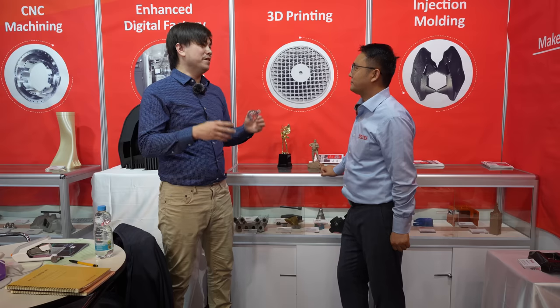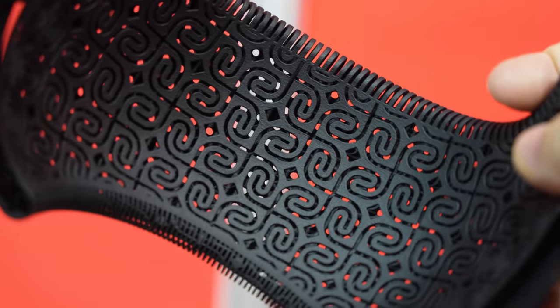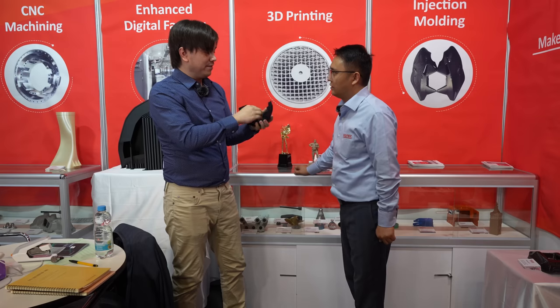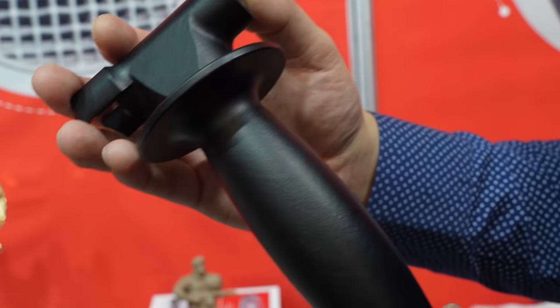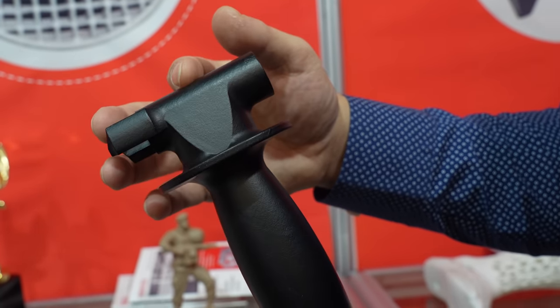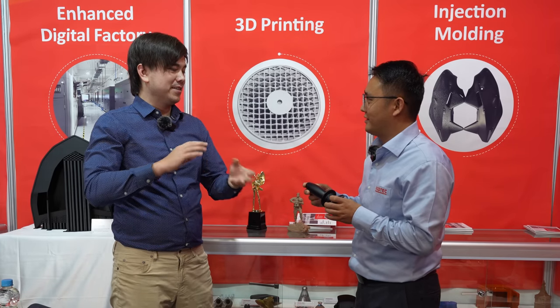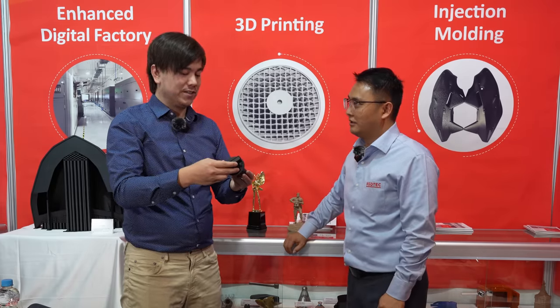So like if you had a movie set in the future and you need some costume elements, you can print those out. You were showing me this helmet earlier — it's kind of interesting. It's got this spring pattern built into it, so it's making a flexible element out of a hard material. MJF nylon with vapor smoothing surface finish. I've seen those machines before — they have like a bunch of solvent inside them and they dissolve the surface of the material, so that just kind of hides the layer lines and gives things a more professional look. Also waterproof — it can make the part waterproof.